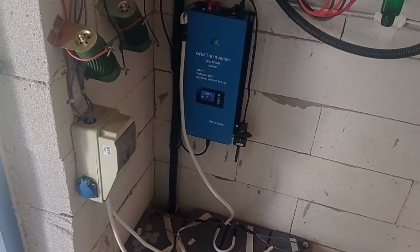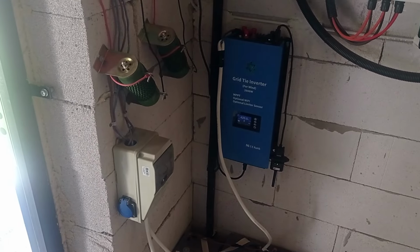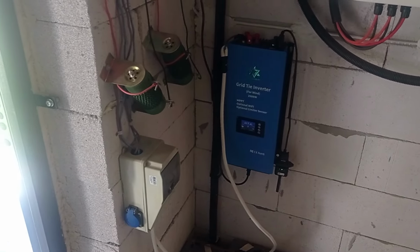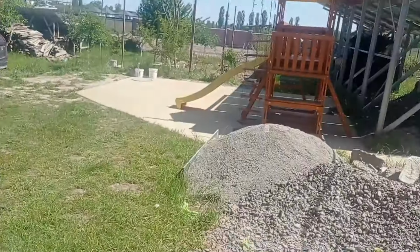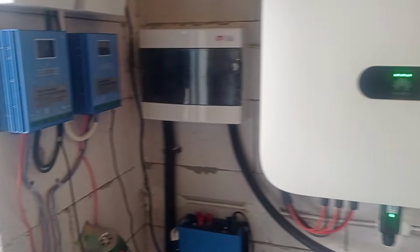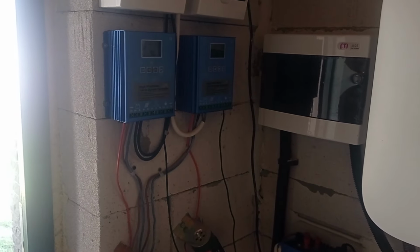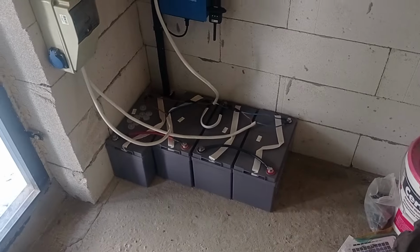So the problem is that I will need something extra, and that is a diesel gen, which I currently cannot supply into my hybrid inverter because it's one phase and I will need a three-phase one. I don't want to buy one because I already have one. So it'll be just like the very cheaper version, just to add this additional inverter, and that's it. This will resolve the issue, maybe, as I said, at the cost of $300 only. So this is my idea for you.